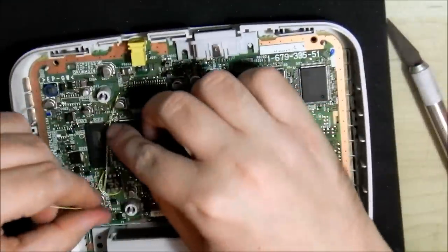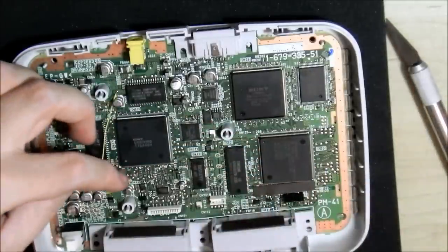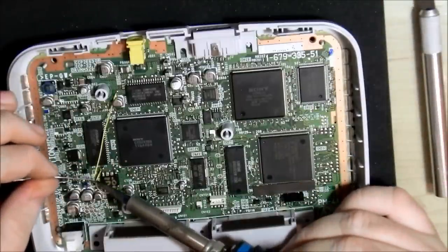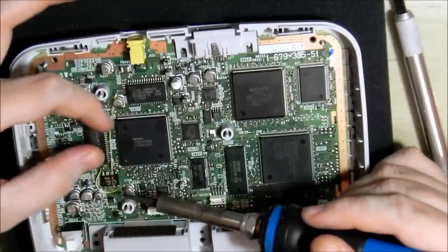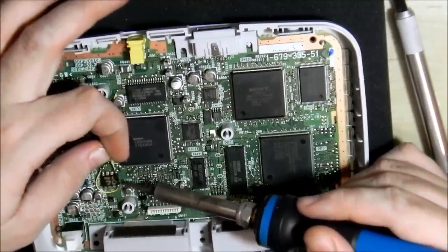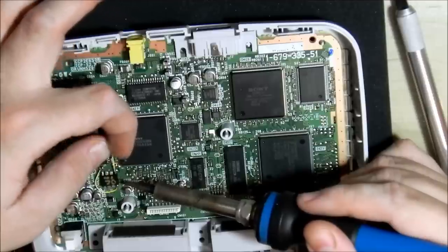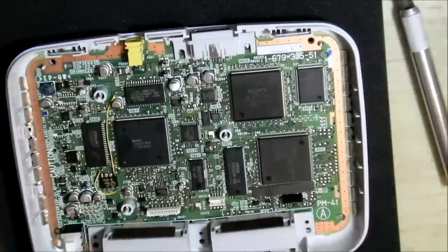I'm not using the scalpel today just to cut the wires, because you can't really apply a lot of pressure on the chip with just adhesive holding it down — logically it'll cause a lot of problems very quickly. The problem with using this technique is it gets a bit more difficult to keep track of everything; wires are a bit longer and not as neat, but I'd rather have functional wires than broken ones.